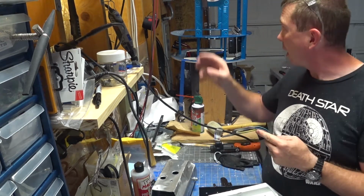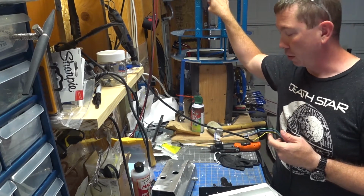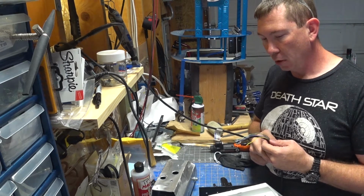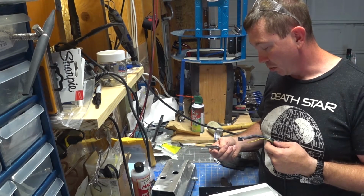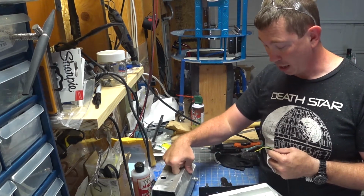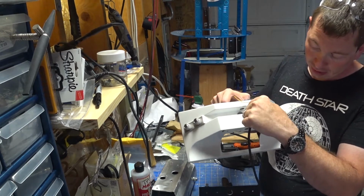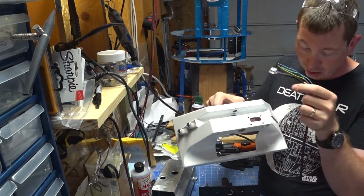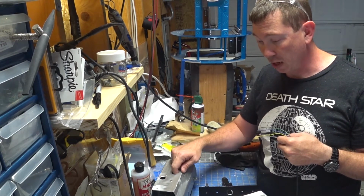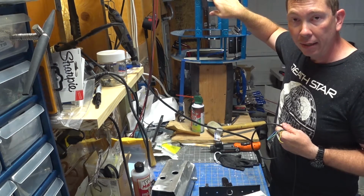That's okay. Kevin and I had a long conversation about the sizing on these. I just said, hey, what if I ran a 13/16 bit and widened it just a little bit, just enough that I could get the head through. Or what if I took it to 7/8, or whatever. 13/16 fits fine. So this has been widened to 7/8, and this hole has been widened to 13/16. And it's not as free moving, but if you're only running it through carefully, not a problem. Again, it drops right through there. So when I do my other Q85 bracket, I will do it at 13/16, not 7/8.